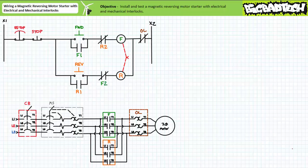This complementary double layer of protection ensures nothing unwise happens either electrically or physically, and ultimately allows only one contactor at a time to be closed. Push button interlocking is a means of supplementing mechanical and electrical interlocking and is not meant to replace these methods. A push button interlock deselects one mode when another is selected. We'll examine push button interlocking when we discuss plugging circuits in later lectures.